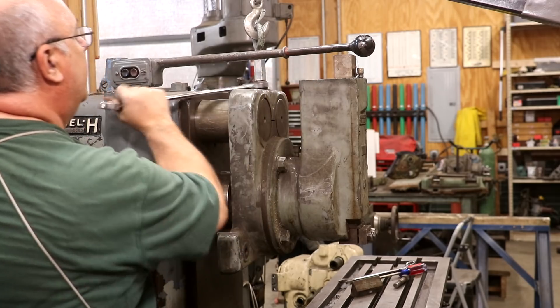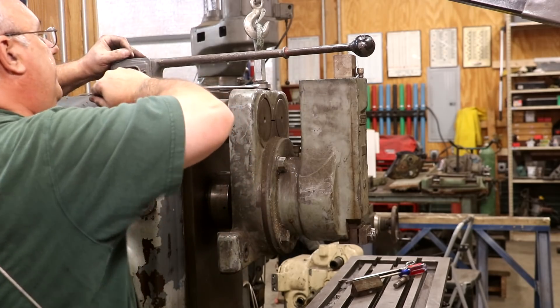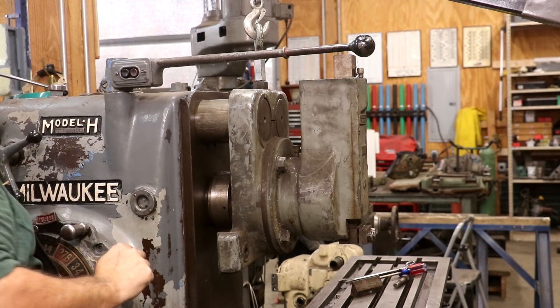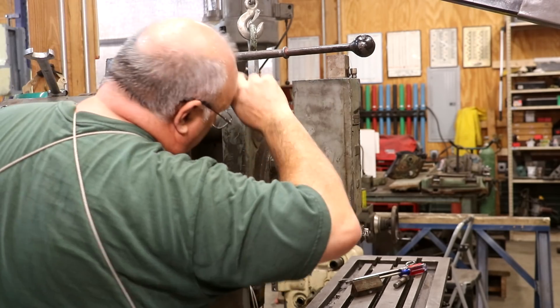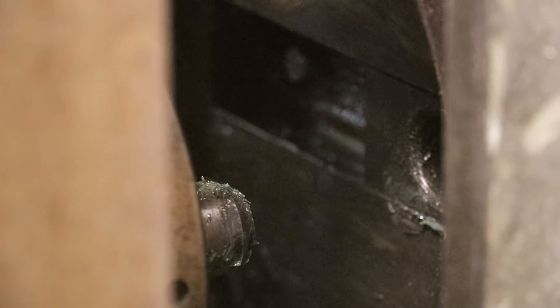This nut here should pinch down, squeeze these together, and tighten them up ever so slightly. We can move our head in and out now. I think I can actually take the crane off — let me go ahead and do that. I've got you looking down between the crack between the head of the milling machine and the shaper head, and you can see the pin and the hole. I've taken some time to try to get these lined up pretty well. Hopefully it's just going to slide right up on there without too much trouble when we pull that overarm back — but you've got to make sure you get that lined up.